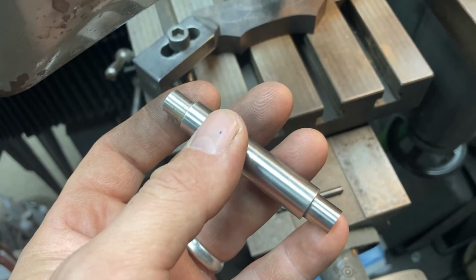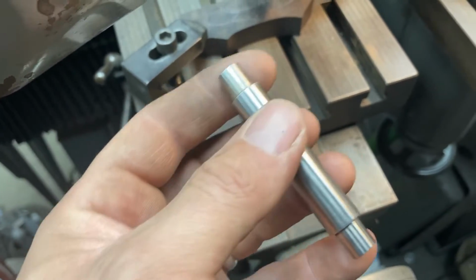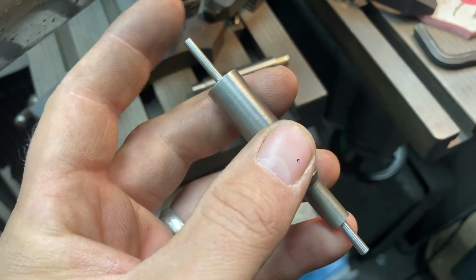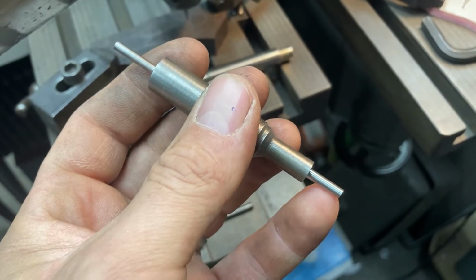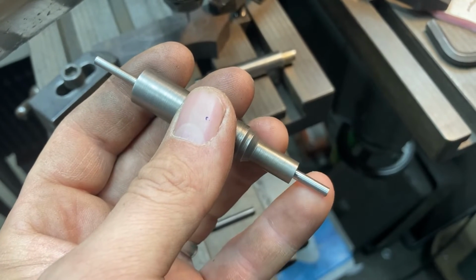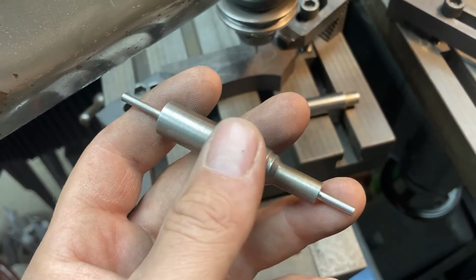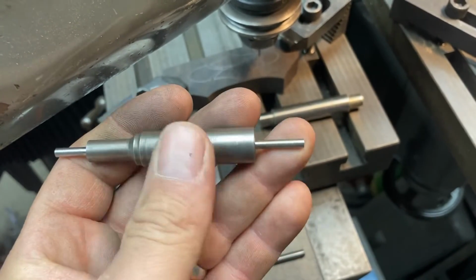And then after I'm done with the 3/16 end mill, I'll switch it up and I'll use this double-ended 1/8 collet that's just been turned on the lathe. This is exactly an 1/8, and this is 130 thou on this end. We'll use the 1/16 end mill, rough it out, all the little corners with the 130 thou. Then we'll try fit the inlays. And if they're still demonstrably too tight, then we'll go with the spot-on size, the 125 thou